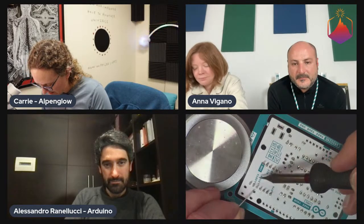But yeah, so this is how I do it. These two bad solder joints just hold it for right now. And then that allows me to go and solder all of the actual pins nicely. And then when I get to the bottom, I add a tiny bit of solder and reflow this joint, and then it's all good. So there are definitely different ways you can do this. And then I'm gonna reflow that one and do my ground pin last.